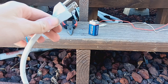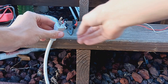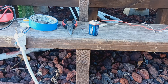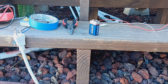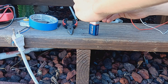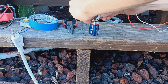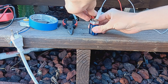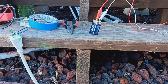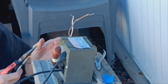The drill method was absolutely garbage, so I had to spend a few hours just banging on those — I believe they're called punches. Then I had to test a cable that I could plug into a wall and make sure I was using the right two prongs. There are three wires in this and I didn't know what they were, so using an LED I was able to determine which two wires I needed. It doesn't matter which way they go because it's just a transformer and transformers work both ways. Then I bound up the wires using just a pair of pliers — honestly there are better ways, but that was the best I could think of.